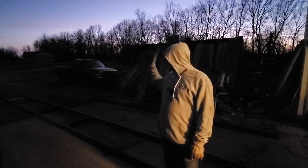So when you're working in these kind of conditions where your concrete is not perfectly flat, it's not perfectly level, and a good 10 foot or so of your frame is out there over the rocks and you just have no idea how level that is, I got some boards underneath there kind of shimming it up. Luckily, there's a slight grade to the rocks and it's actually going down. Because if it was coming up, that'd be one issue of water backing up, and another issue of trying to build something here, right? So anyways, I've got this cross member here that I still have to cut to the proper size. And of course, we're going to have to put gussets and everything in because this is where the axle is going to go, and that is, I believe, 6'3" from the back end. So we're going to have 6 foot 3 of tail.